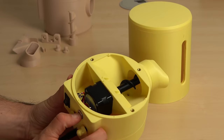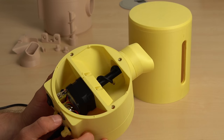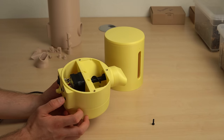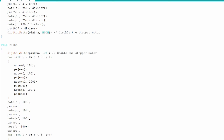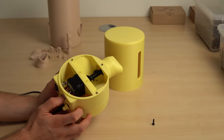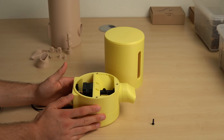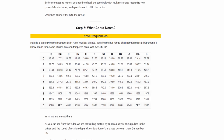The standard settings for the dispenser are quite fast and big pellets sometimes get stuck. That's why I added a safe mode in the program that switches the dispensing sequence to a mix of forward and backward rotations, which has shown much better results with big pellets. Since I did not install any output like an LED to show which mode the device is in, I added a small jingle with the motor frequencies to indicate mode switches. If you switch to safe mode with five pushes of the button, a part of the song 'Rain' by Rob Skellen is played. If you switch back to standard mode, you can hear the Super Mario jingle.